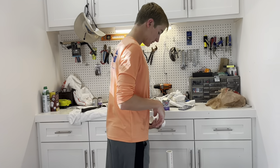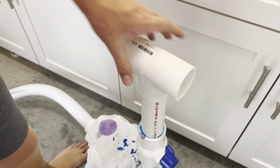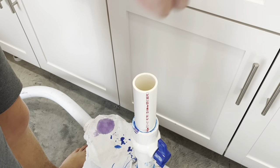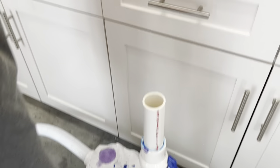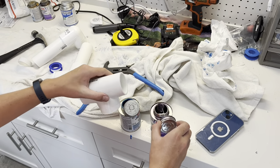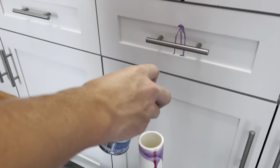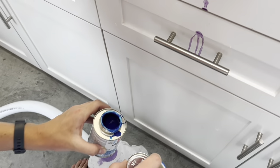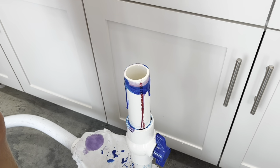So if you come real close, I'm going to glue this tee together and then glue the top part together. If you're ever wondering how to glue a pipe, you just take this purple primer right here. I want to go primer right here, primer, and then glue, and then primer. You can just do glue on this tee, just the top one.